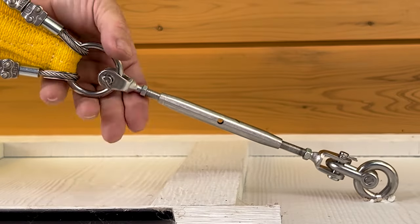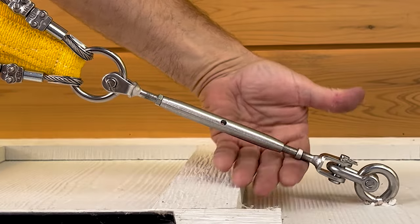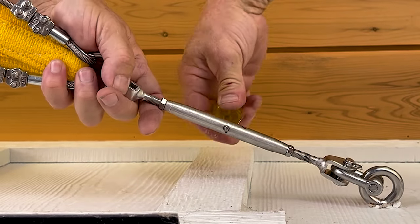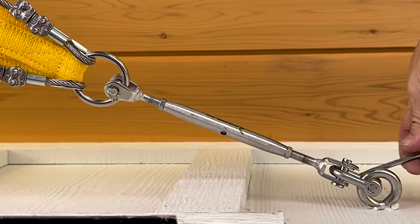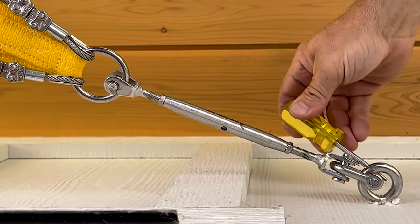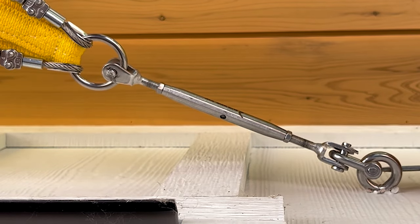I'm going to walk these nuts into the center of the shaft - see this, I'll wheel these in and I'll wheel this other one in. This turnbuckle is getting pretty tight and I know I have a full turnbuckle on the other side, so I want to lock this off here. You can also get a pair of pliers and lock it. I also lock this shackle pin, because when the wind comes and moves this even slightly it might loosen it. You want to make sure these are locked - really essential for never having to come back and maintain these all summer long.